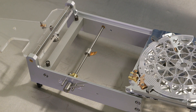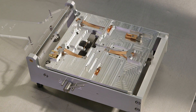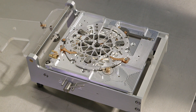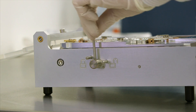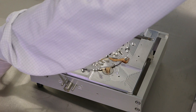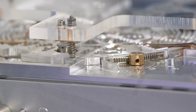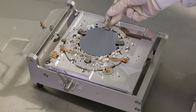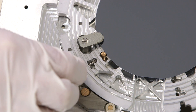The operator first loads the substrate into the substrate carrier. This is done by using the loading jig provided, which enables the springs on the holder to be depressed so that there is room to load the wafer. To clamp the substrate in place, the loading jig is released and the wafer is placed in the carrier in a three-point, front-facing position.